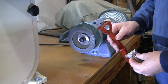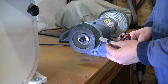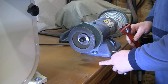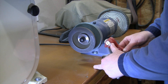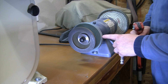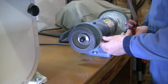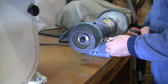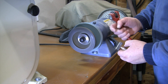I just use a regular star dresser, and I also have this diamond dresser to really true up the stone if I need to. Even though I don't have a tool rest, I'm able to brace my hands down here on the bench to use either tool. I'll typically use the star dresser to flatten out the wheel. Right now I've got a little bit of a divot in the middle from sharpening one of my radius tools, so I'm going to use the diamond dresser first to just flatten that off and get it nice and squared up.